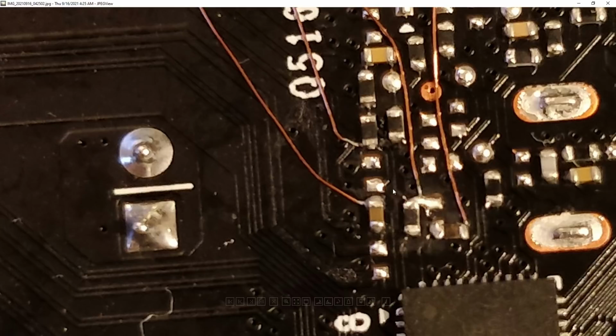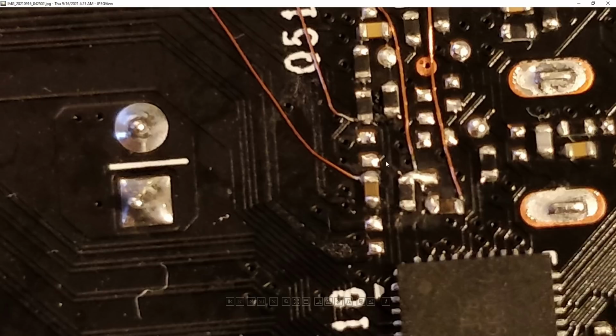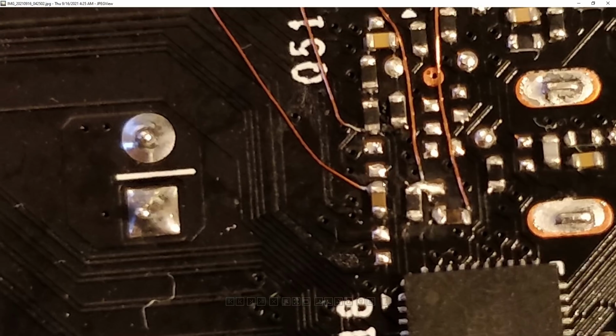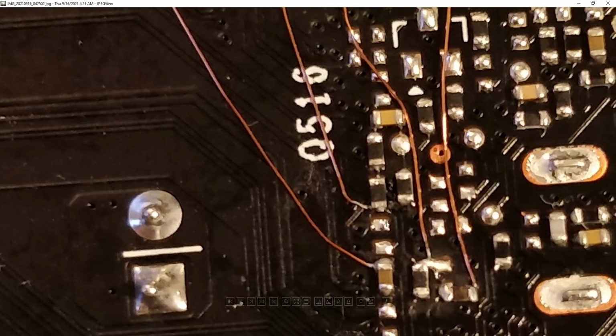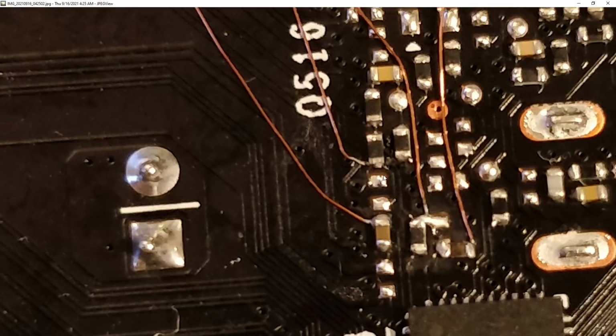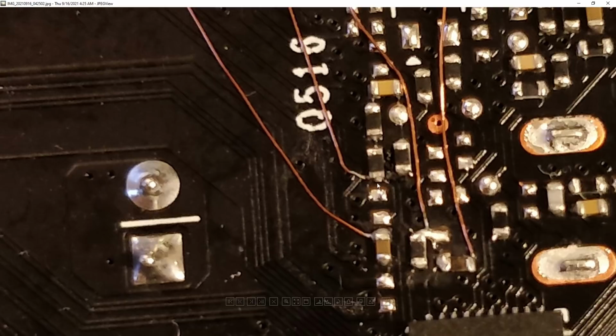Okay? Honestly, I'm surprised that MSI designed the card like this. These two pads being so close together is just, I'm really not a fan of that. That is terrifying, that those are close together. Now, obviously, if you're not modding the card, then nothing really should go wrong with it. But if you had a conductive speck of dust land right there, bad day, very bad day. But you shouldn't really, don't cut metal near GPUs. But that kind of goes without saying.